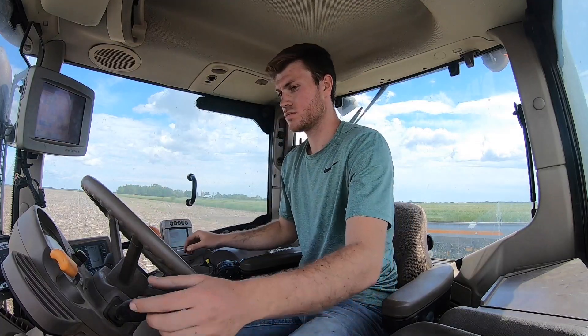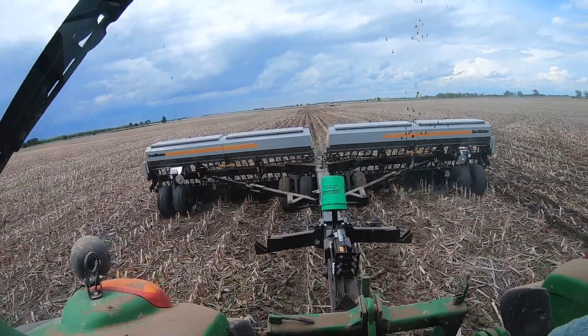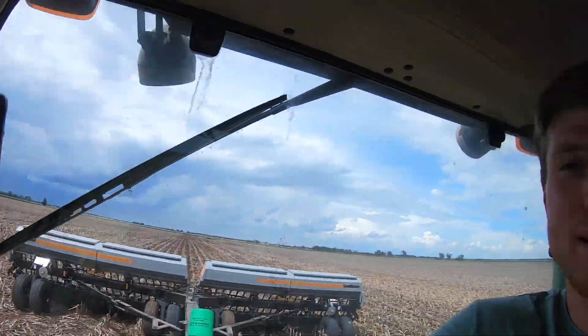It's time to mount up and see how this drill works. The closing wheel was leaving it really firm — I also couldn't turn the closing wheel with my hand, which is one way to check your down pressure. It seemed like we had too much down pressure, and one of my six tires wasn't even touching the ground. Pretty clear we need less down pressure. My dad started driving it and it looked like the seed was coming out really good. Now we're starting to get worried about that blue sky over there — it looks like it might rain and we just started this field basically.